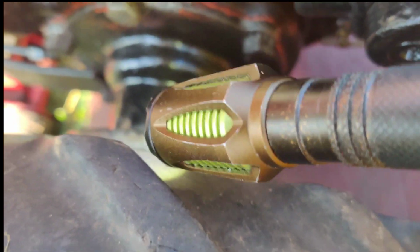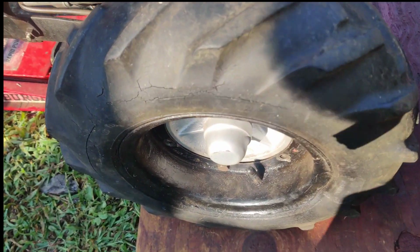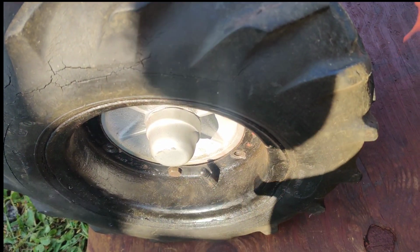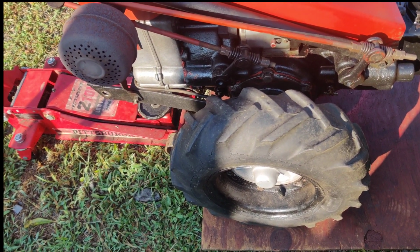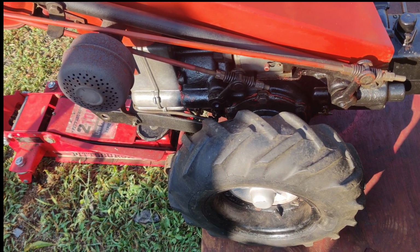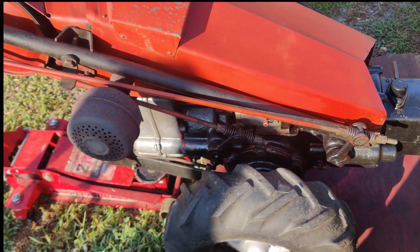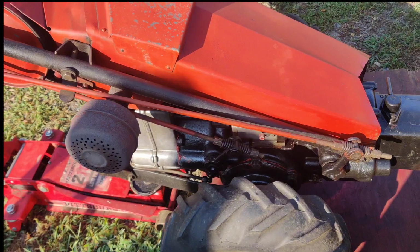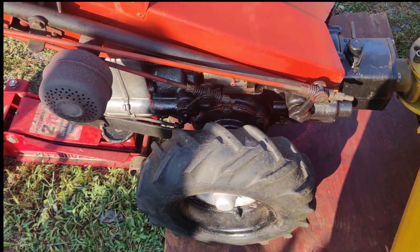So next thing we're gonna have to do is I have to order the oil seals for it. And I'll call Richards. The thing is, this has solid hubs. I'm hoping I get the hub off. So if you're going to do one side, you do them both. We'll do both sides. So all the other work we did on the differential's fine. Nothing's leaking there. It probably wasn't leaking in the first place. It was probably always the axle seals.